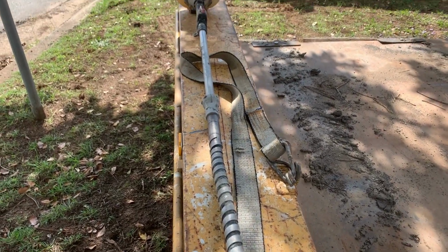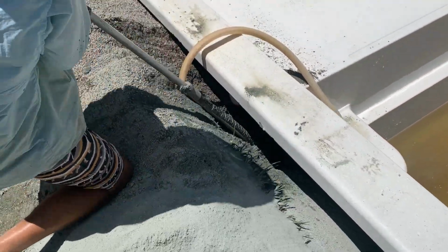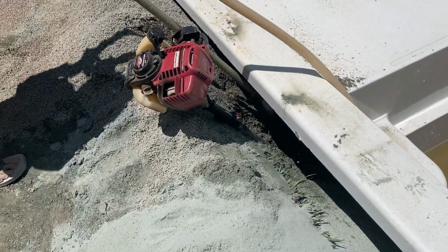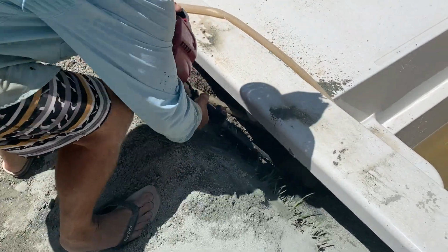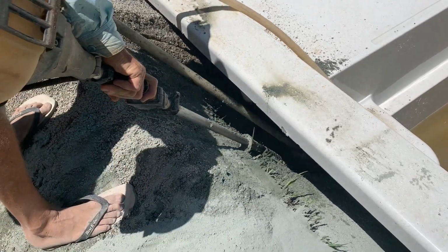Once you've washed the backfill in and around and underneath the steps, this vibrates the backfill all the way up and under. So it's just getting that next level of compaction. That's why they call them pencil compactors, in the areas where you need to do this, which is your steps and your swim out ledges or underneath benches.